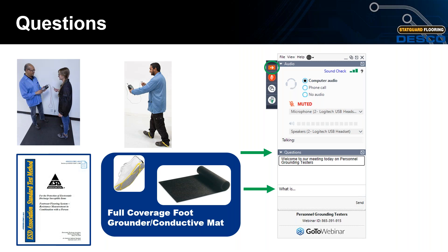All combinations means your entire floor system. If you have an ESD floor and operators wearing foot grounders, you have to test that entire system to verify that the resistance to ground of the operator is under 1×10⁹ ohms, and that the body voltage peak is less than 100 volts. So 'all combinations' refers to the foot grounders or shoes the operator is wearing together with the flooring substrate or floor finish.